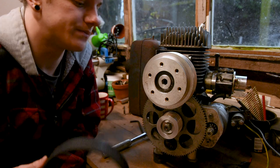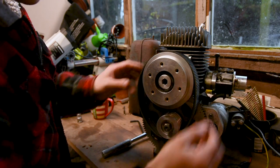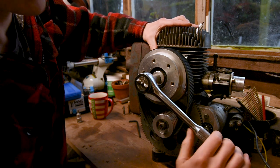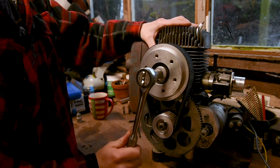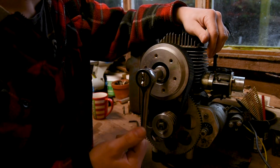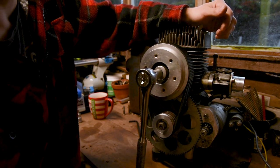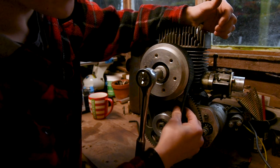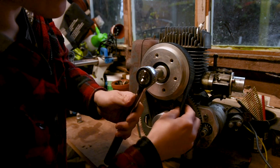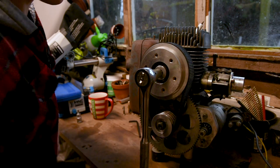Let's get this belt put back on. We're going to start by putting the bottom on first — it's already loose from when we just loosened it before. Pop that on there like so. Take your allen wrench and place it back in the centre of the pulley, and you're going to want to tighten this up this time — round to the right — and that's going to bring that pulley up and tension this belt. To know when you're tight enough, the figure I've seen online is between 20 degrees flex and 45 degrees flex. Tighten that up, give it a little bit of a twist and see where you're at. Some machines will hold their pulley in place like this one has, so you can then go and tighten up your pinch bolt.